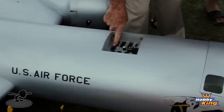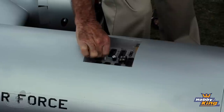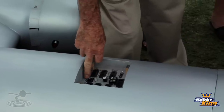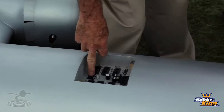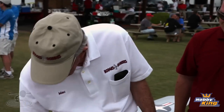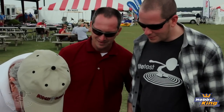And most chargers don't like a common ground. When you start charging, it'll see the common ground and it'll think that the cell count doesn't add up. So I've got a jumper here going to the negative wire coming out of the switch to pull this out, and that interrupts the common ground. In other words, the negative wire from this switch goes to here, and that interrupts it. So you only have one ground wire going, so when you're charging the battery, it doesn't see two ground wires.